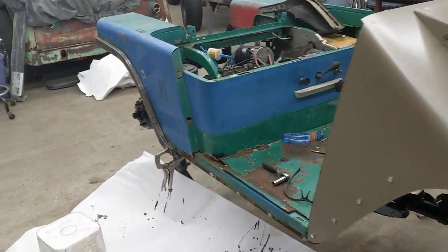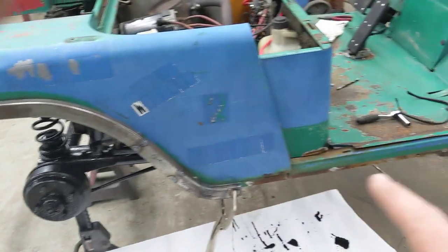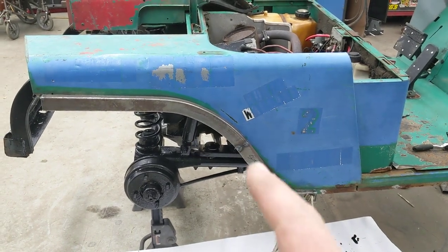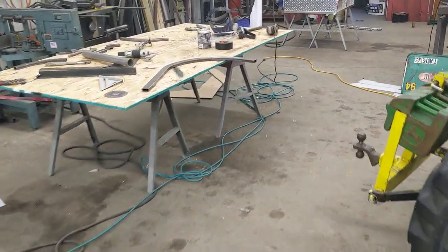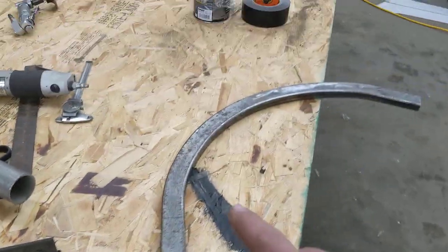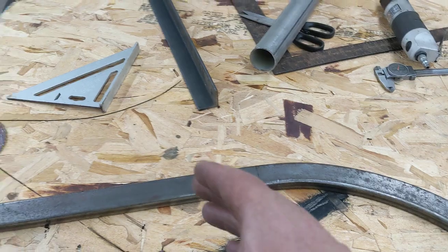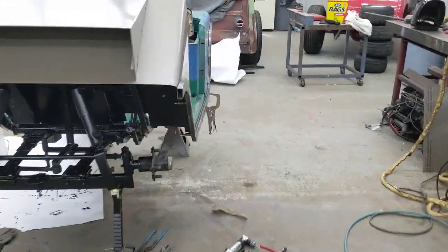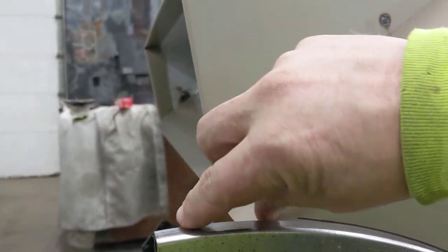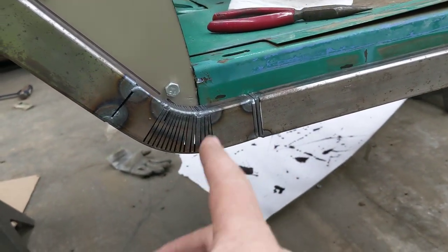I did the hood a couple days ago. Today I've been working on the tubing that goes around the fenders. I explained in another video that I was gonna do tubing all the way around the cart — I have the other side just about complete. I brought some tubing to a shop and had them roll it the hard way, as they call it — inch and a half by three-quarter, 14 gauge. They made me six identical pieces. I've been making marks wherever I need to cut to go around my wheel wells.